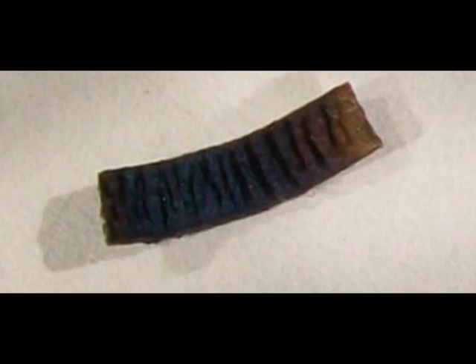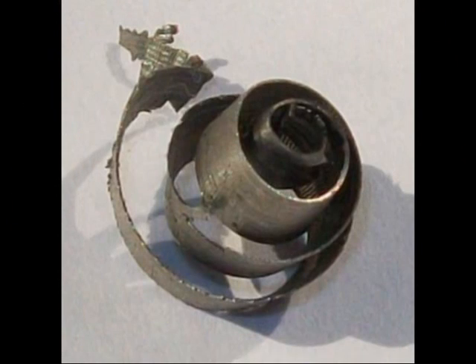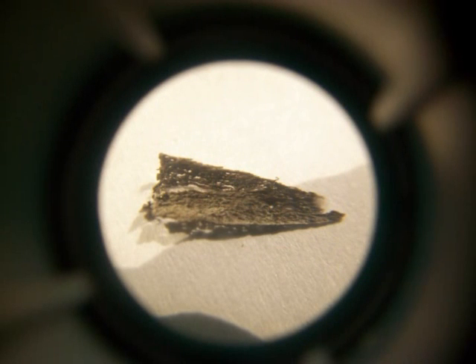You can see the serrations now. This is a continuous ribbon type of chip. These are found when mild steel was machined at 525 rpm and a depth of cut of 0.25 mm. When the major cutting edge of the tool is aligned parallel to the lateral face of the workpiece during plain turning, or at a circular face during facing, we get these types of chips.